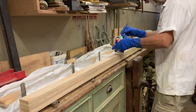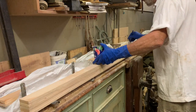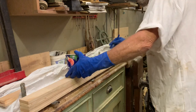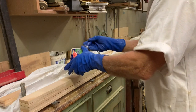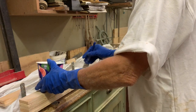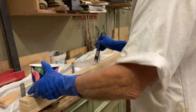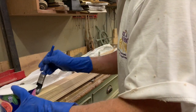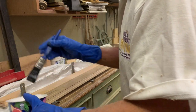My beams will be tapered from 3 inches thick in the middle to 2 and 1/8 inches at the shear clamp, so I've set the brackets that I'll laminate the beams around to be the shape of the underside of the widest beams. The actual camber or crown of the top of the beam will be marked to a greater curve and cut out.